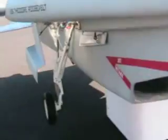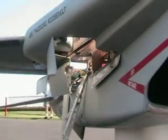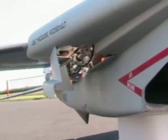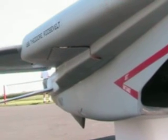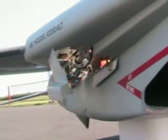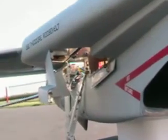Landing gear — I had a little bit of trouble with that, but that all worked out. Now it works just fine. I had a slight leak on one of the mains and have been working on that. Pretty much got it solved — it's a very slight leak now. I lose 5 psi in 10 minutes, so that's not too bad. And overnight the gear holds all its pressure, so the whole air system is pretty tight.